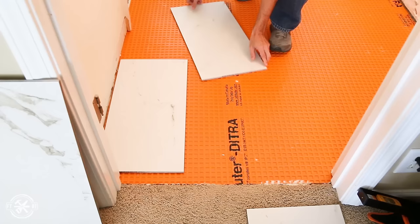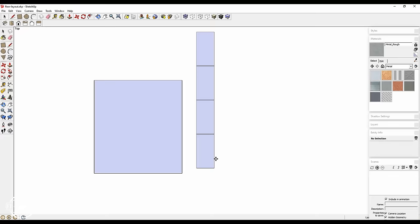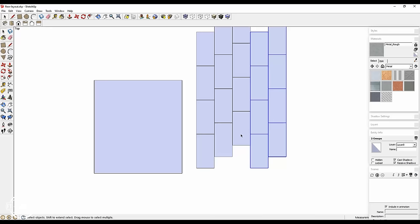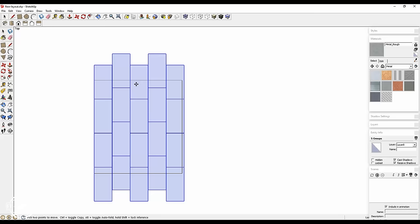I'm using a 24-by-12-inch large format tile and spent some time trying to figure out the best layout. I used a program called SketchUp to lay out the size of my floor and my tiles with the grout spacing I wanted. This let me try different staggering placements to see how they looked right on the computer screen. My goal was to have as many full tiles as possible and make sure I didn't have any small slivers near the walls or the doors. We settled on a brick pattern layout with a third of a tile overlap, which helps to reduce lippage when two tiles aren't level with each other — more prone on these larger tiles because they aren't always flat.